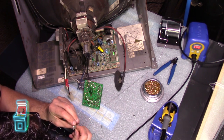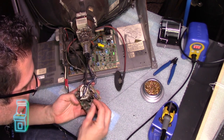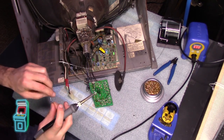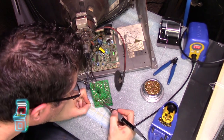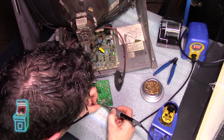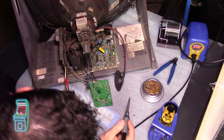Instead of waiting for the CR31 adapter part, I'm going to go ahead and change the pots anyway. I ordered them from Arcade Parts and Repair - Peter over there is such a great guy. There are 200 ohm and 2k pots - six total, four on top and two on the side. I also ordered a lot because I have another K7000 in my inventory that needs a cap kit, and I usually change out the pots when I do that. Let me also show off these magnifier glasses - there's a light, they're adjustable, and the lens ranges from 3.5x down to 1.0x. They strap to your head, come with attachable glasses, and they flip up. Really cool for fine PCB work.